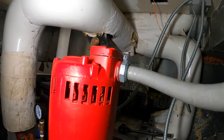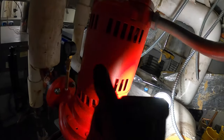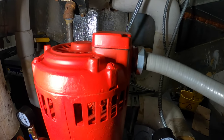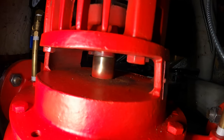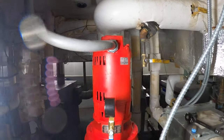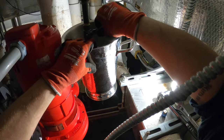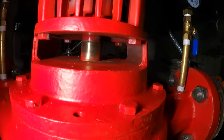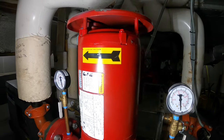I connected the electrical — we had three wires coming in, three phases, and we have three wires at the motor. The rotation needs to go this way. You put any three together and check the rotation — if it's correct you're good; if not, switch any two wires. I have a separate video going into further detail on that. The system's on, it's spinning right now — beautiful. I'm going to air this out a little bit and flush some water out. It's been pumping for over half an hour, no leaks, everything is good to go — moving in this direction with the arrow going that way.